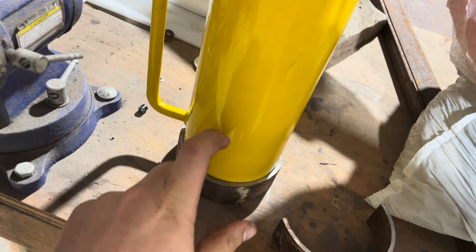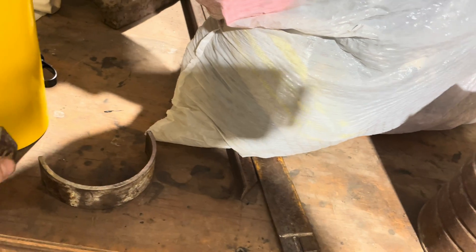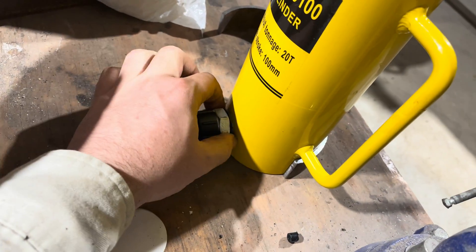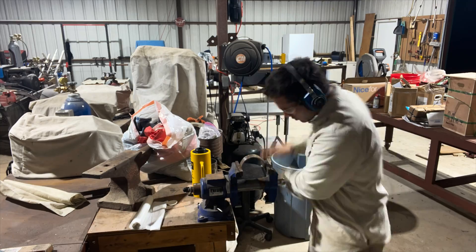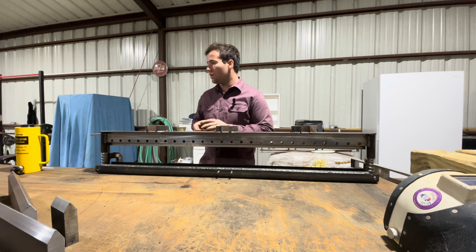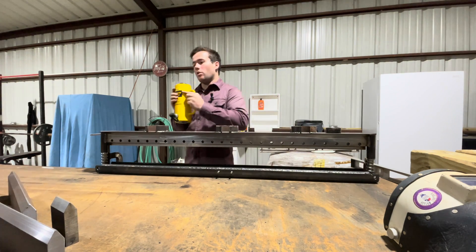I just cut the pipe in half and bent these brackets a little bit in the vise to make them snug around the bottom of the cylinder. I have to make five of these — cutting some into three pieces for the back side, because the front side sits nice and clean while the back side has the port for the hydraulics, so I drop a piece on each side so nothing interferes with that port. We got the pipes welded on, and the pipes for the top of the presses fit really snug on top of the jacks.